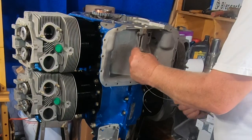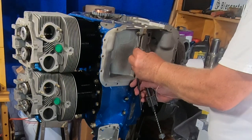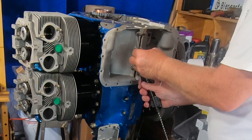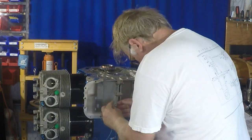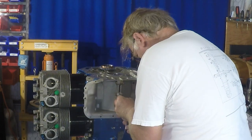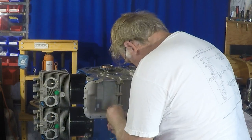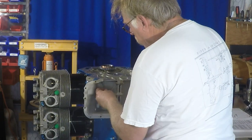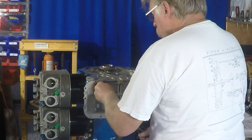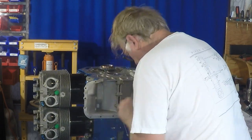And for those folks that are getting hung up on safety wiring, just so you understand, the safety wire doesn't hold the engine together. The reason for the safety wire is to retain the hardware if that bolt or that nut gets loose. You've obviously lost the mechanical clamping of the joint, but it's to keep that from fodding out something else in the engine or the machinery, whatever you're working on, whether it's a carburetor, fuel control, turbine, whatever. So it's not to hold the engine together. Safety wire is not to hold the engine together.